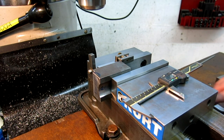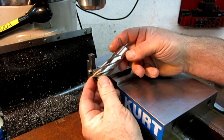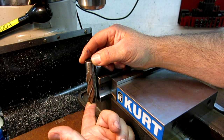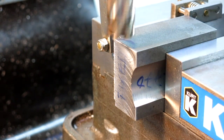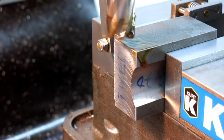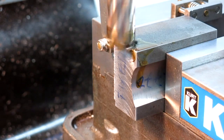Now I'm going to make my cut. We're going to use an annular cutter — or rotobroach — and this particular one is a two-inch length of cut. Let me put it in the spindle and we'll get cracking. We're ready to go at about 200 RPM. Double-check my numbers — I'm good, go for it.